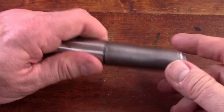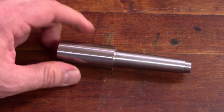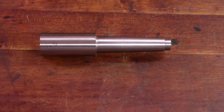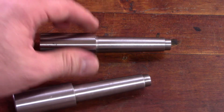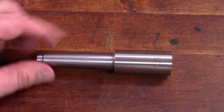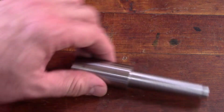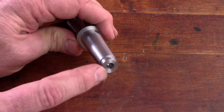I overshot the diameter and the sleeve was a loose fit, so that's not good. I ended up making a second one, starting all over, and this one turned out right — it's a good fit, and actually if you push it on too hard you can't get it out without knocking it out with a drift pin, so that's good. The original end mill holder has a shoulder on the end; I'm not sure what purpose that serves but I did the same on mine. My next step is to reverse this in the lathe, chuck it up in the spindle, and take a real light cleanup pass on that section so I know it's concentric with the taper. Then I'll reverse it again, hold it in a chuck, and drill and tap the end for the drawbar.